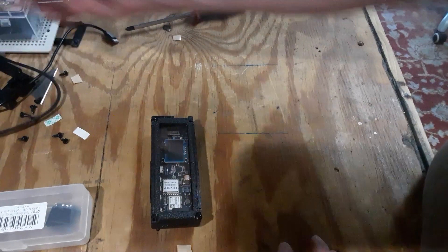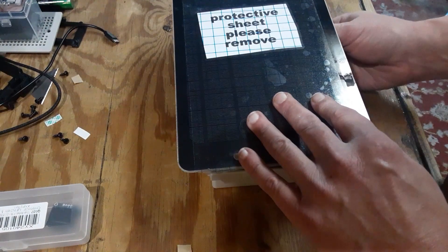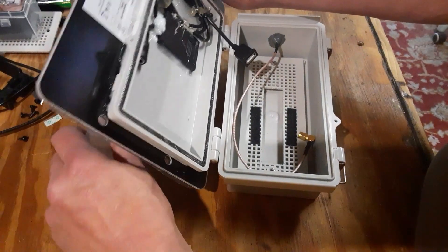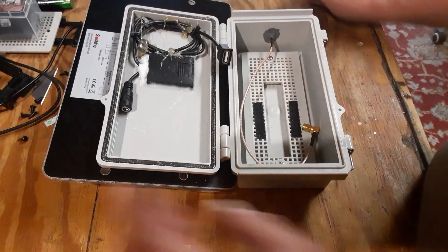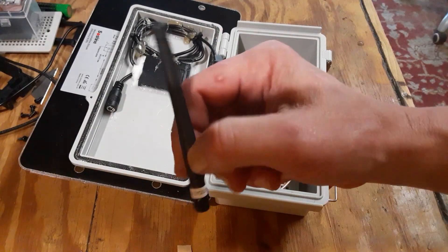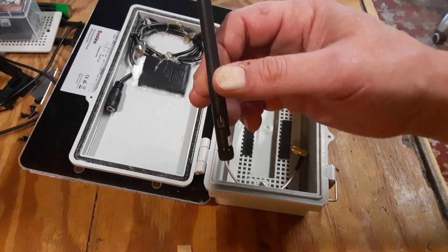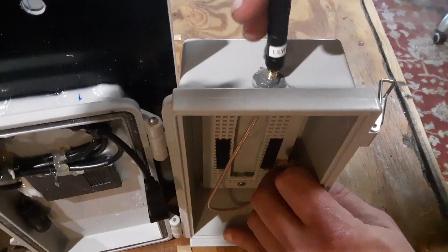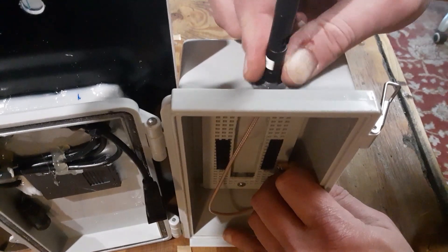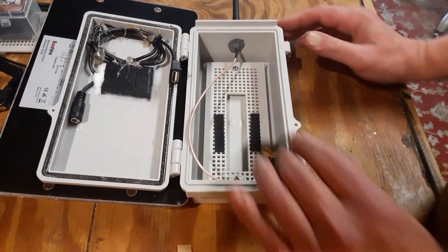Now move this antenna out of the way. Bring your solar node enclosure out and open it up — you can use the T-beam case to kind of hold that lid up while you're working. The first thing we're going to do is attach this antenna to the box. You can use your factory antenna, though I recommend a better one. Screw it right into this port here. Remember: on a T-beam, if you power it up without an antenna connected, you'll be ordering another one because you'll burn up the radio chipset very quickly.